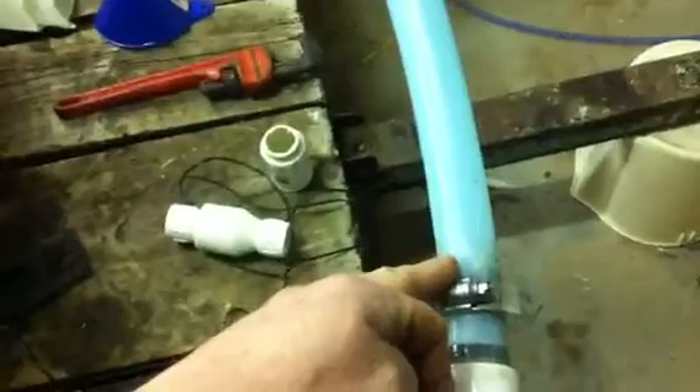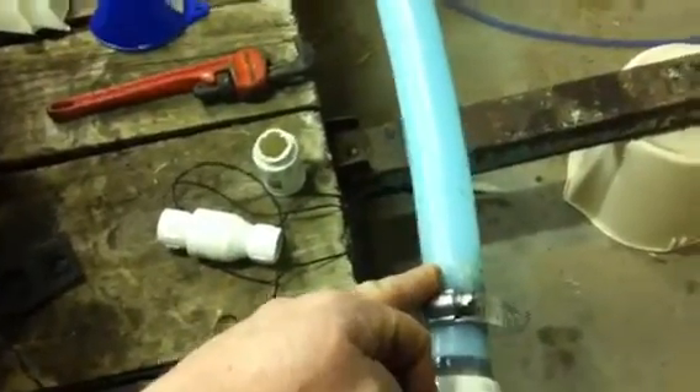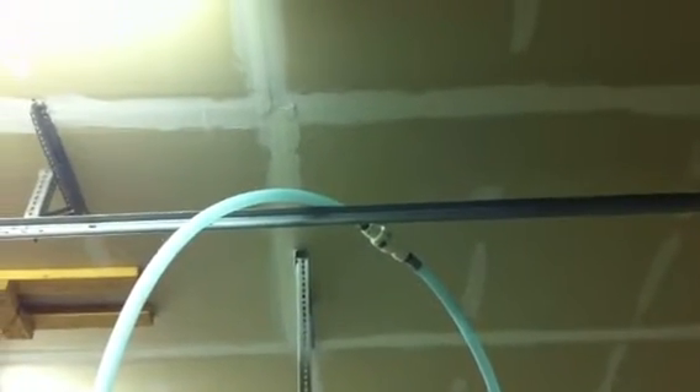This is my outgoing sap line coming off my pump in the woods — this is going to pump up to a vertical head of 15 foot over our sugar bush driveway. For testing purposes here I have 12 foot ceilings; I've draped it around my garage door at roughly 10 foot high. That gave me a good example making sure I can pump it up over the road in the sugar bush.